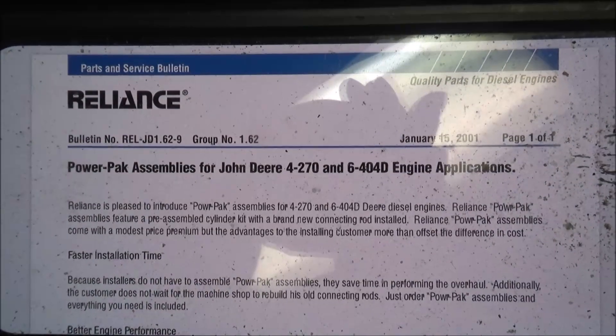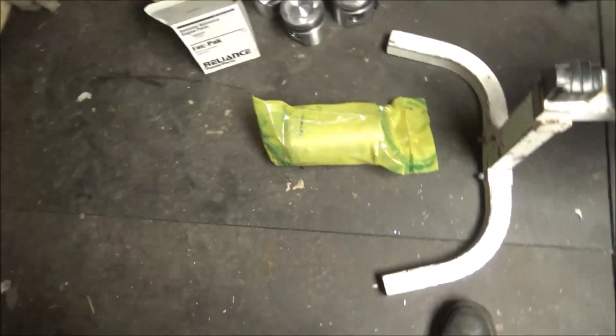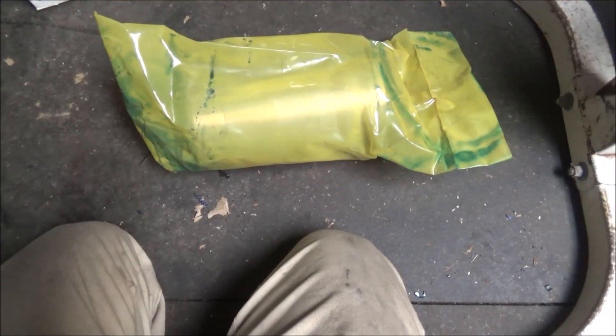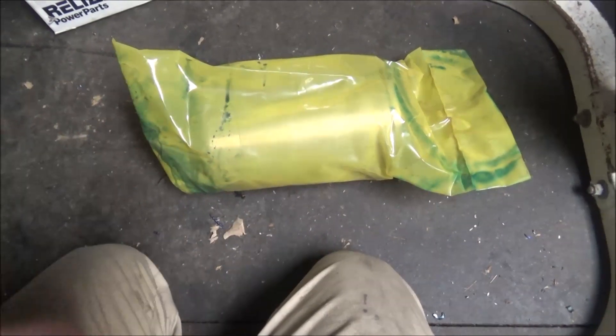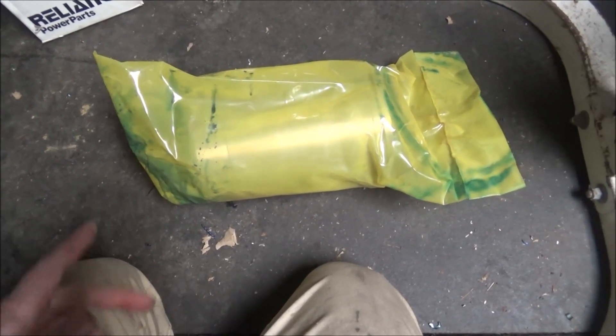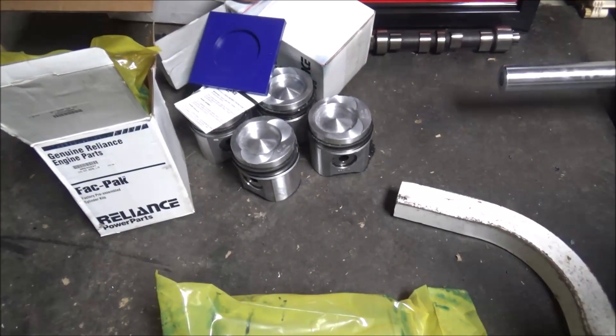Pre-assembled cylinder kit. I don't know what their intention is because I didn't find anything specific. In John Deere world, they can't expect you to push the liner out of the bottom, put the wrist pin through your connecting rod and stick it back together — they don't recommend taking the liner assemblies apart. However, I'm going to say you can skip that. If you're capable of rebuilding an engine, you should probably be capable of getting the pistons back in without breaking the rings. That's the main reason they do it — sometimes people break the rings taking them apart. But let's take a look at what I found machining those.